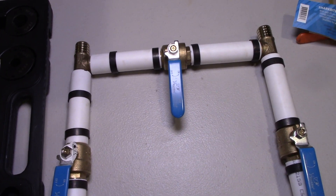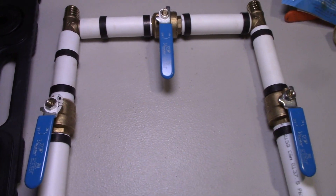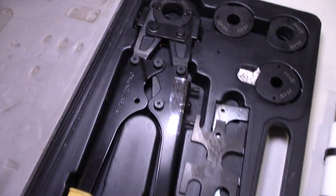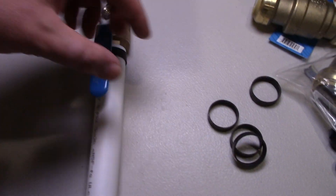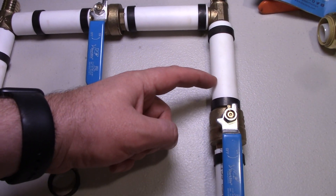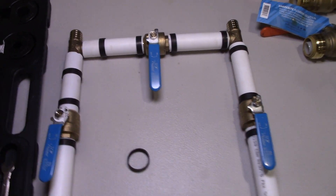There are two types of brass fittings you can use. I'm using the crimp brass fittings — these are actually SharkBite parts. I'll put a link in the description below. The crimp fittings require a crimping tool. You do save money going this route, but you do need the crimping tool. They have these copper rings that clamp the fitting that protrudes into the pipe about three-quarters of an inch. This is all just dry-placed — I haven't crimped any of these parts yet.